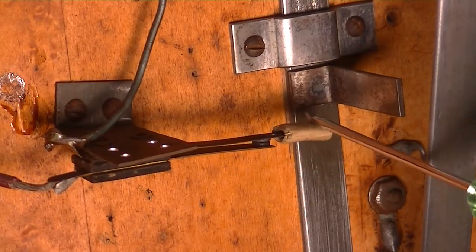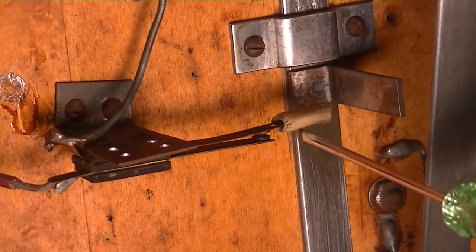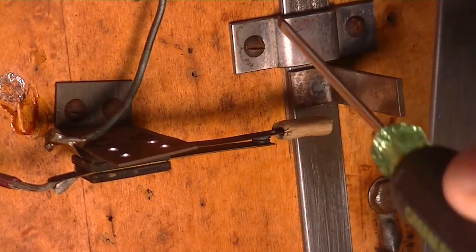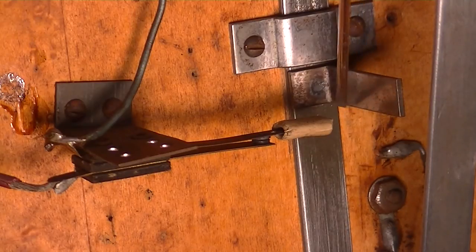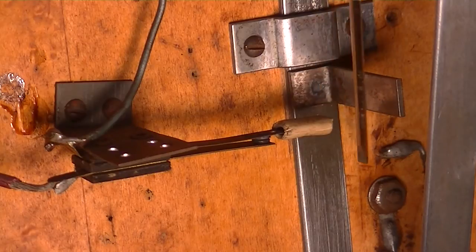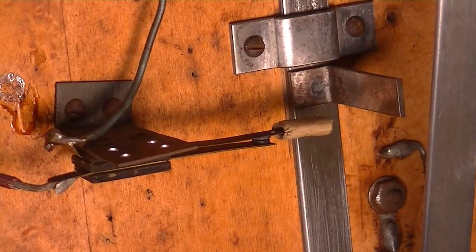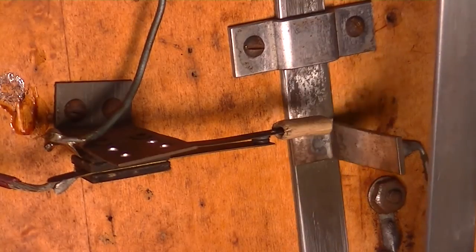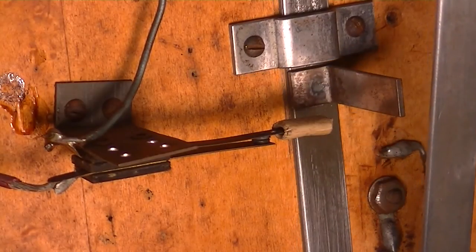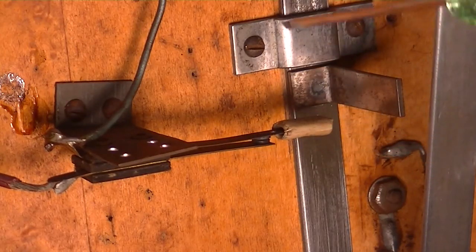You can see there's an insulated piece on here. It looks like something should be pushing this down or pulling this up or doing something. This piece here is made to make switches — I don't know if at one time it was extended out further. But the way it's set up right now, it doesn't make any sense. Because when you put the coin in and you reset it, it should be hitting it. But if it did hit it, it's already normally closed, so you're doing nothing — it's already closed.